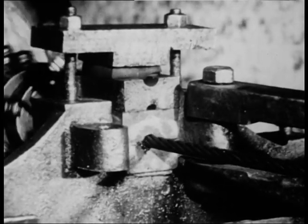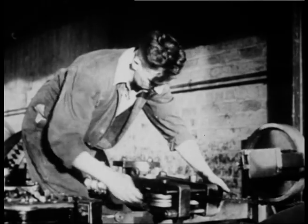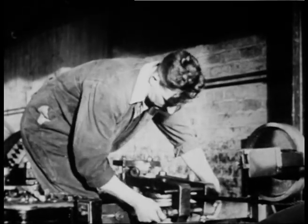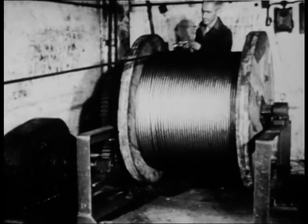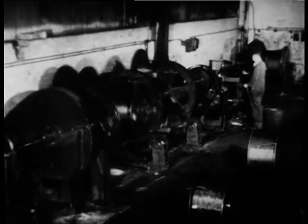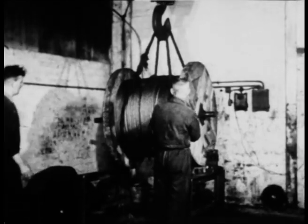The finished rope emerges from the other side of the compression lines. The compression rollers are then put on to ensure perfect roundness of rope. Once more, the finished rope goes round the takeoff capstan and then reels onto the big wooden drum. Someone has to be at hand to ensure the even guiding of the rope onto the reel to avoid damage to the rope by crossing. And so the drum of finished rope is complete and ready to be taken away for dispatching.